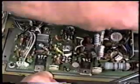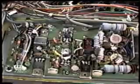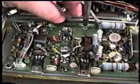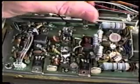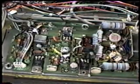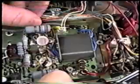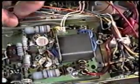Now there's one remaining that I missed, and that is on the thermistor. Let me show you that. Yep, we did miss one of the screws here. There's one more up at the top, which is holding the PC board down to the heatsink. This one is holding the thermistor, which is the heat sensing device for the fan circuitry on the PA.